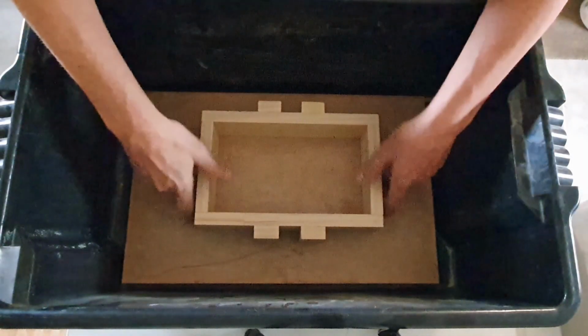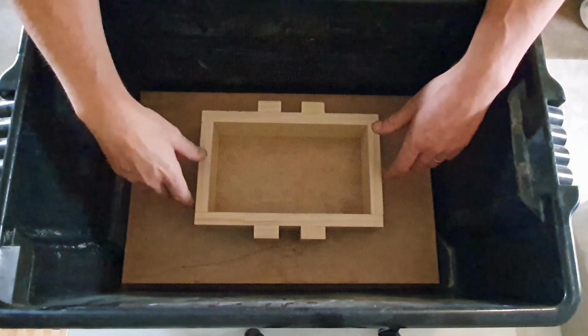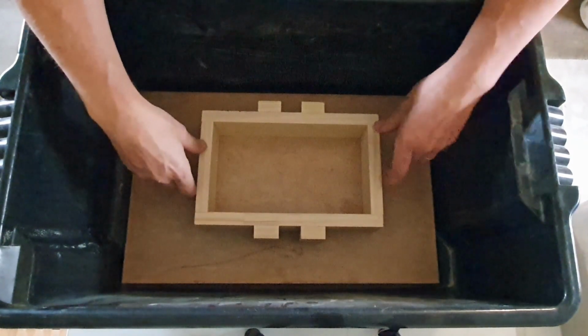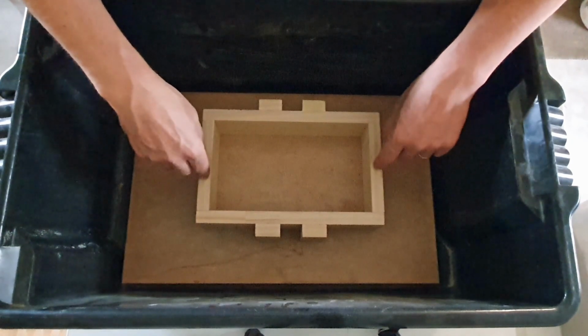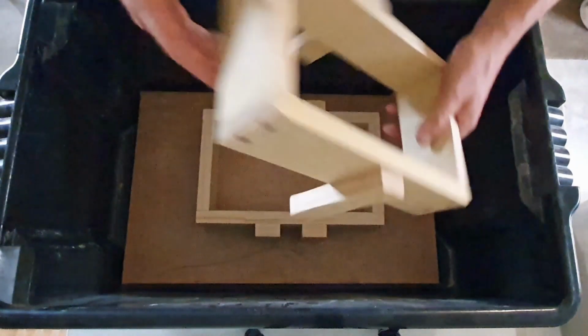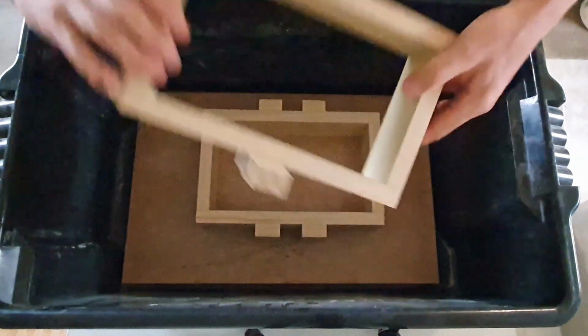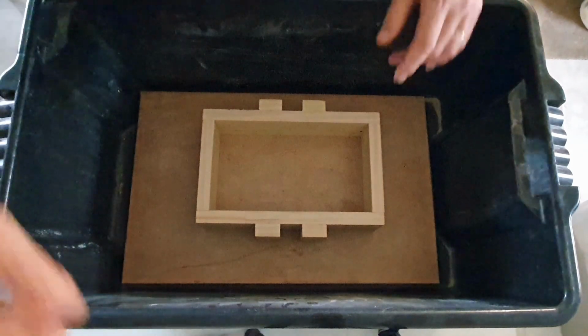So I'm going to ram this up in a container just to contain the sand. I haven't got a dedicated area for doing this yet, and I don't want sand everywhere. We've got the drag on the bench at the moment, where we're going to put one half of the pattern, and then the cope, we'll do that in a little while, and we'll put the other half of the pattern in that. So let's start